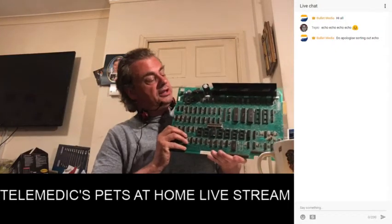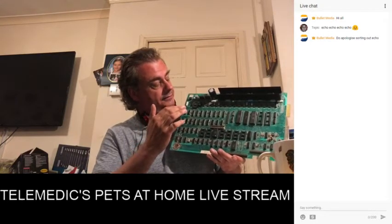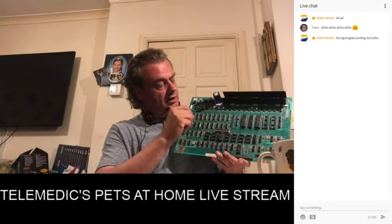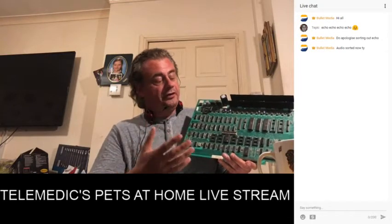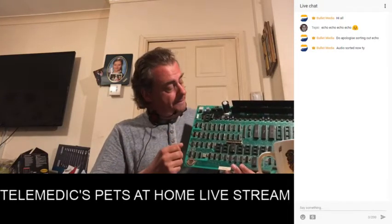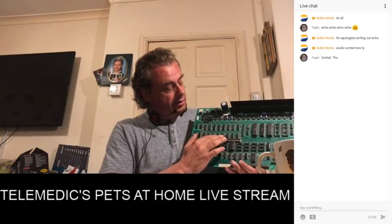With this particular device, we have several items that are of interest here that we need to know about. This here is the main system RAM. The system RAM comprises dynamic memories which have to be refreshed. So those are also very power hungry, and I intend to change this by going to static RAM and also drop the chip count by using more modern items. So that's the main 32K of RAM.